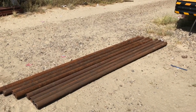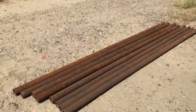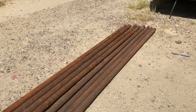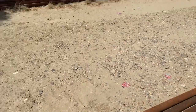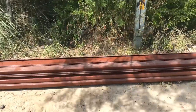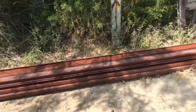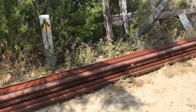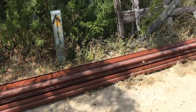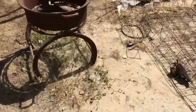Steel Masters here in Riggan City came over this morning around 8:30 or 8:45 and dropped off this three-inch drilling pipe. It's going to last quite a while, so I'm going to use that as my posts. I have purling over here that's going to be my surround, and I'm going to build my trusses out of the four-inch purling. The garage is 24 feet deep and 16 feet wide, and then the carport is 12 feet wide, so four-inch is more than enough.